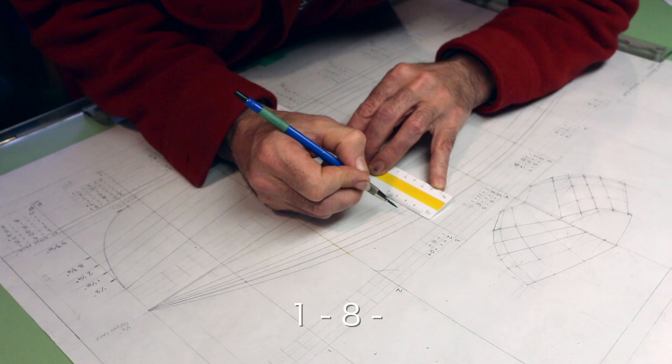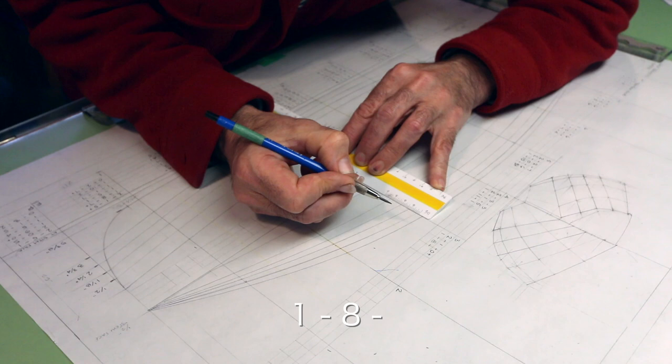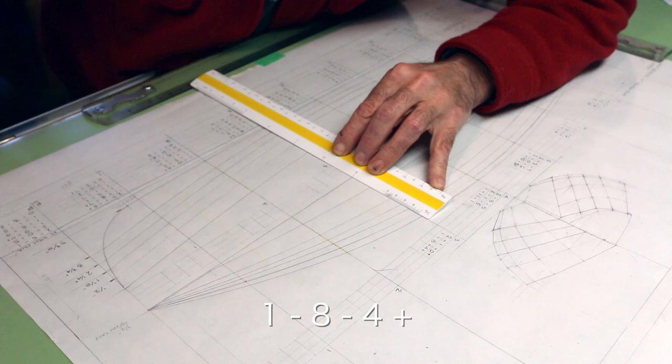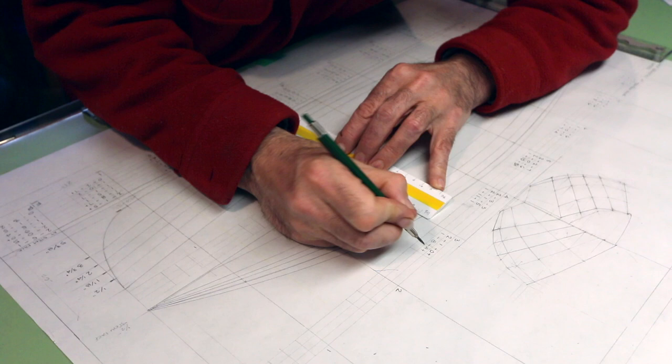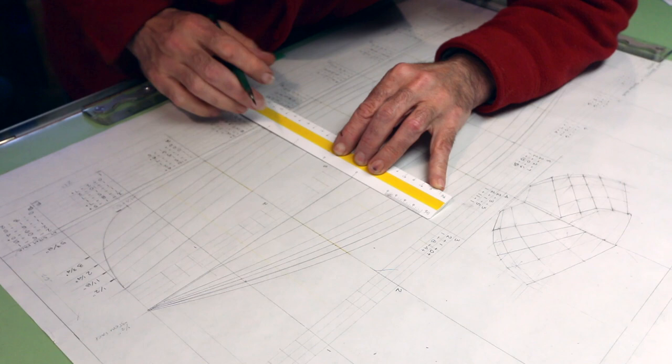And this is where it gets a little trickier, because we switch to something we're not used to thinking about. So the number of eighths, in this case, it looks like I land just above 4/8, but not 5/8. So I would say 4, and then we use a plus sign to indicate a little bit more, or a 16th more. Sometimes people don't use plus signs. Sometimes they'll go up to the next number and use a minus sign. But I use a plus because we often have a little dash between numbers, so that can get confusing if you use minuses as well.